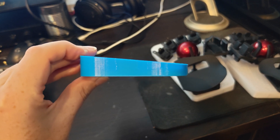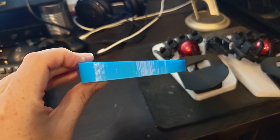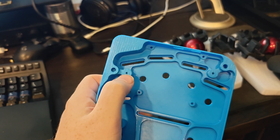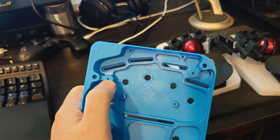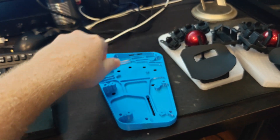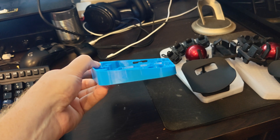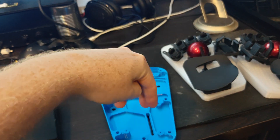Most of it will be machined like this, but I need a setup where that top face is flat. I need to put a series of holes there — the bigger holes are for holding rubber silicone inserts for the feet, and then there will be threaded M3 holes that will hold an acrylic piece I'll machine out that fits in here, so when you look at the metal bottom you can see the internals.